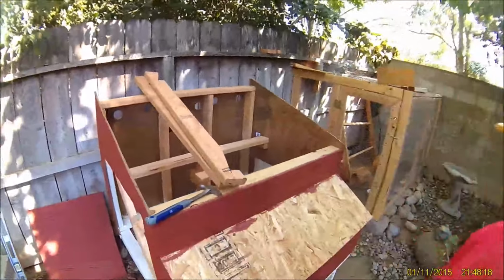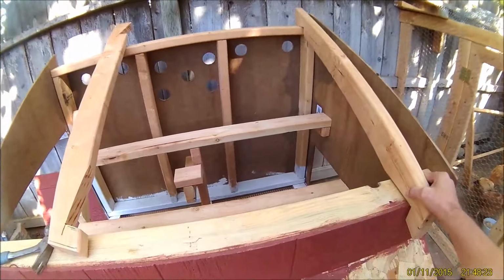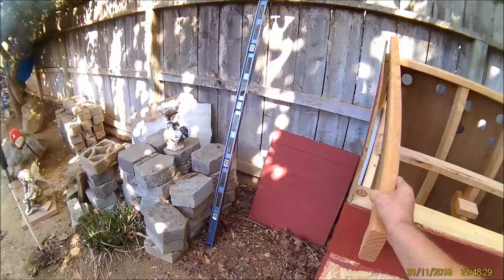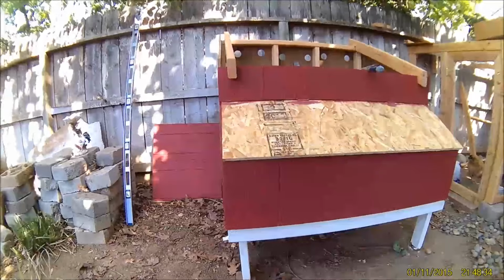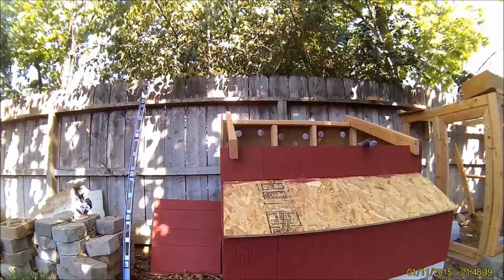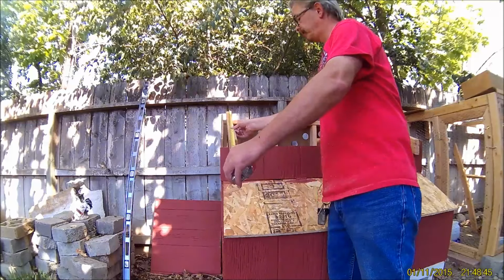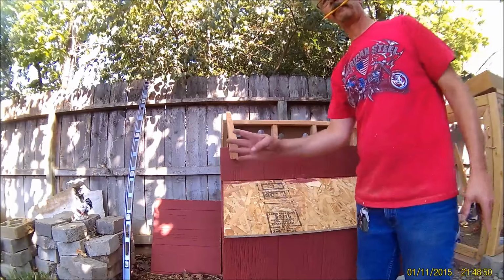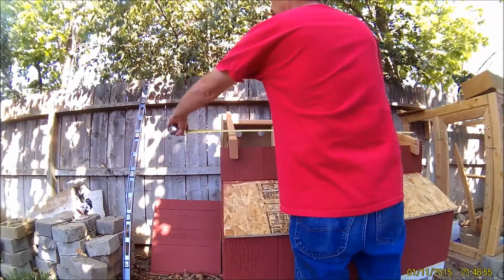Okay, so all that's left to do is the roof. I'm going to set these boards over here. I'm going to just have them slightly away, maybe a half an inch or so away from the side walls. And then I'm going to put some supports on the 2x4s right and left. I'll show that in my next video, and then I'm going to take a 4x8 sheet of plywood and just cut it 5 feet long. That'll give me a half foot overhang on the right and left, and it'll give me a little bit of overhang forward and back. So it works out perfect.